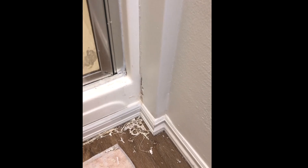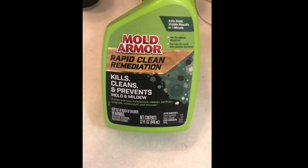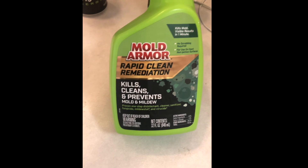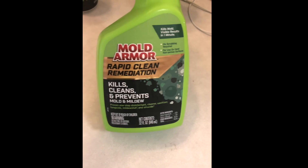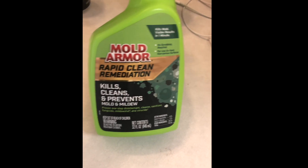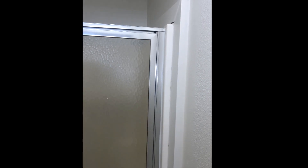Quick progress report — the scraping is done. This product worked really well. You're going to want to wear a respirator or dust mask — a good one. Spray everything down and wait about 15 minutes, maybe turn the ceiling fan on. The stuff is toxic, a lot of chemicals and bleach — you don't want to breathe it. But it worked really well; it softened up the caulking and it came off. Took me just over an hour, maybe an hour and 20 minutes.